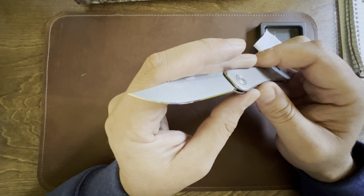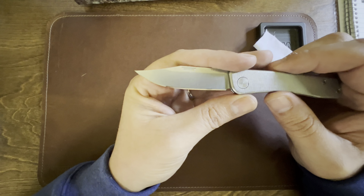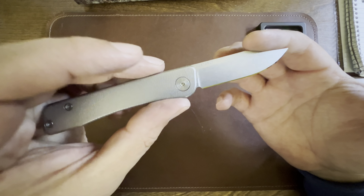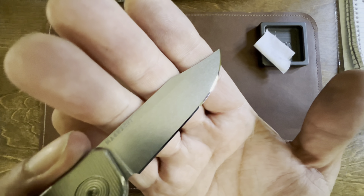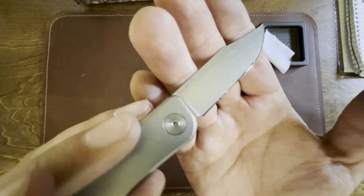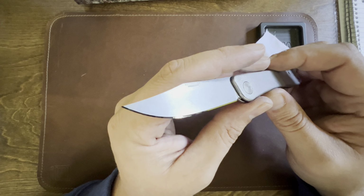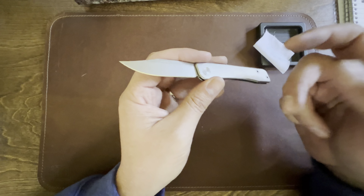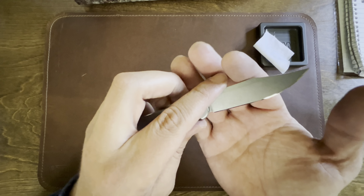And also, you'll notice that I spent very, very little time on my cowhide strops, and also very little time on my kangaroo strops. So the lapping films, I finished on 1 micron lapping film. It had it looking just beautiful. It was awesome. I was rocking and rolling. And then I put the leather strops on there, and it actually started to reintroduce some scratches to the polish that I already had. So my cowhide strops, they are very old, and it actually came with my Pro Pack 2 that I purchased. So they're original, and they've had a lot of knives put under them, cleaned, I put the paste on several times, and they've had just a ton of knives go through them.